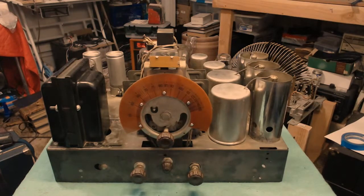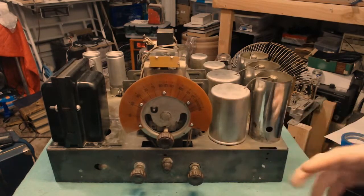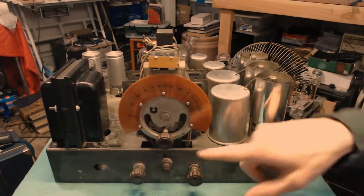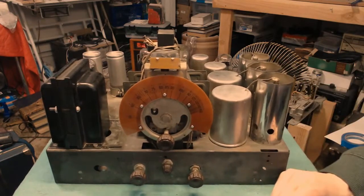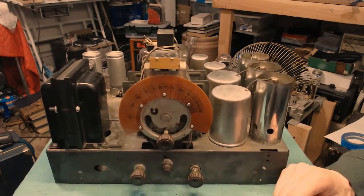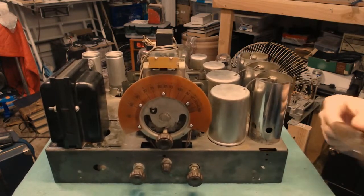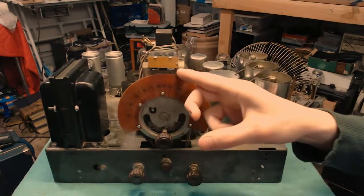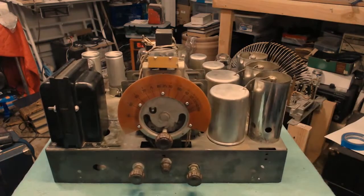And it fits nice. Now, one thing I do want to point out is while the reproduction is flat from the company that makes them, once you actually screw it down to the wheel here, it takes on that concave shape. So it molds itself nicely to how the original was. That way when it actually fits in there, it won't crush against the escutcheon. It won't be sticking up straight and down, and it fits nicely up against this little guy here, which is the diffuser that produces a little line on the dial.